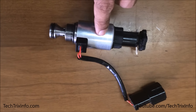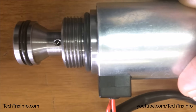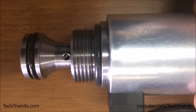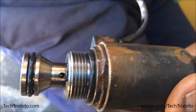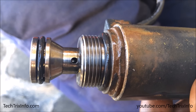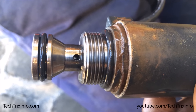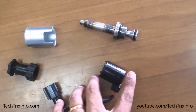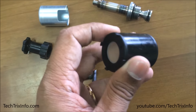There's a body where we have the electromagnet. When the electric pulse is coming, the solenoid valve opens up. In the hole you can see a small silver ball. We have four holes over there — the balls move when we give electricity. That means the body becomes electromagnetic and controls the movement of the balls. When the ball moves, the hydraulic oil flow happens through those holes. That is the electromagnet over there.